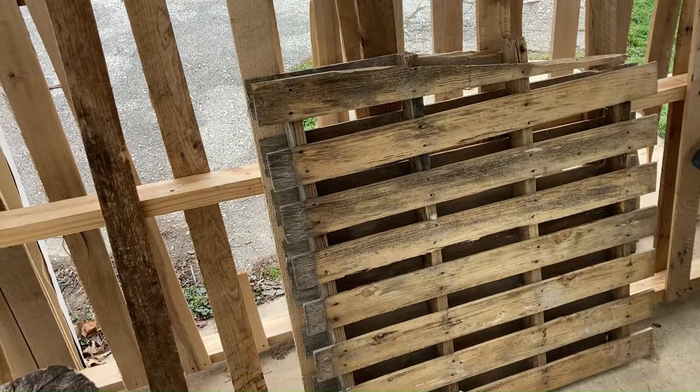I like using pallets because I can get them for free — they're cheap, inexpensive, and a great way to store things. They're very durable. As for disassembling pallets, I've seen all kinds of pry bars and gizmos, but pry bars usually tear up the wood. The best way I've found is with a Sawzall — just cut it and then punch out the nails with a punch. On the larger two-by-four or one-by-four pieces, I usually just hammer the nails in and leave them unless I think I'm going to hit them with the saw.